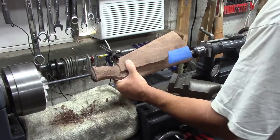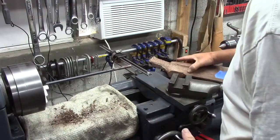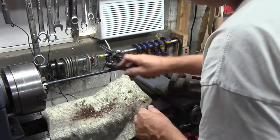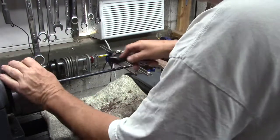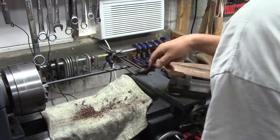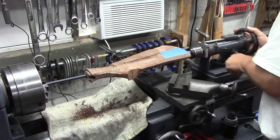These flutes don't come all the way out of the work, so I'm going to have to do lots of cleans. And I guess for that, I ought to get a little brush handy. Oh, here's one. Oh yeah, that's packed. As soon as it starts a little drag, I should stop and clean. It's not going to take very much cutting to fill those flutes up with wood, so back and forth with patience. So we're getting down there though. Look at that.